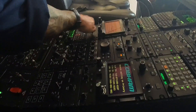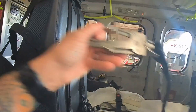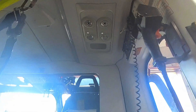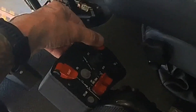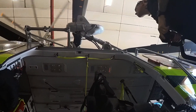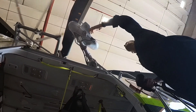The next thing we're going to do is give power to the hoist — that's the first thing I check. I'm going to get my helmet out of the way, put my talon or strap that I use to not fall out of the aircraft away and get it out of the way. Then I'm going to turn the hoist light on and check the cable cut on my side, the pilot side, and the co-pilot side to make sure that the messages are popping up on the screen. Then I'll take the pendant and extend the hoist arm, bring down the hook and cable to inspect and make sure that everything is moving freely.